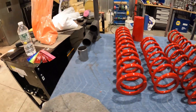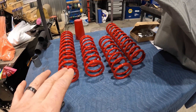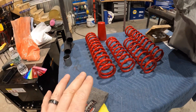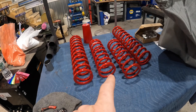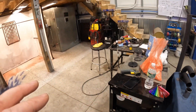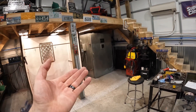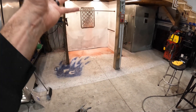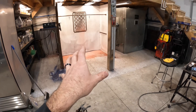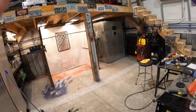Very, very happy with that. For a while it's touch and go because even 15 minutes in the oven they're still very orangey — the red pigments didn't come out until later in the bake cure process. It's essential that your part hits 375 and you let it go the full 18 to 20 minutes. We now have the frame piece in the oven, bringing it up to around 100 degrees, then we'll roll it out and spray it right in the stand because it's so big.